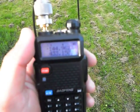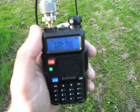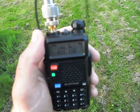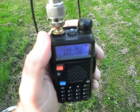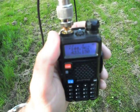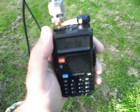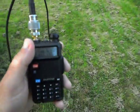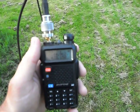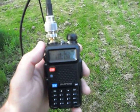The main reason for being out here is that on the top frequency in the 2m band, 144.9625 MHz, a brand new EchoLink node has opened up in the next village to this one. It's only about 3 watts ERP, but only about a mile or so as the crow flies in that direction, so I can get in on very minimal power.